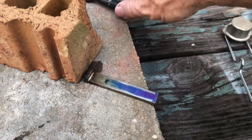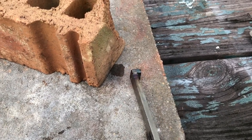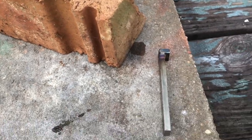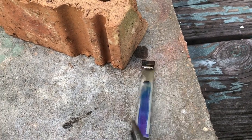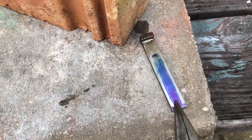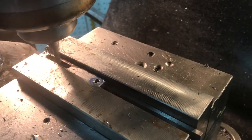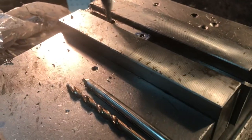One little detail for the spiraling head is the 3/16 inch by half inch guide bars. I'm out here outside — I just silver soldered the end piece on. The book doesn't really say exactly how to accomplish this, but I'm confident the silver solder will be very strong. I'm letting it cool, then I'll pickle it, belt sand it, and machine the slot. Here's a snippet of one of the guide bars — I've drilled a couple of holes at the ends to mark the locations and milled out the slot.